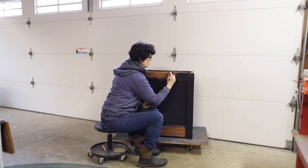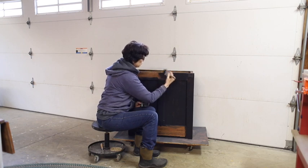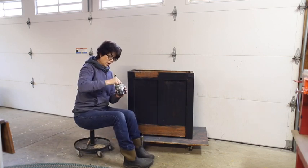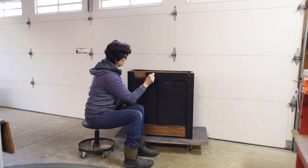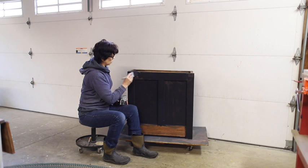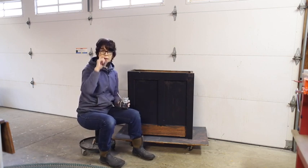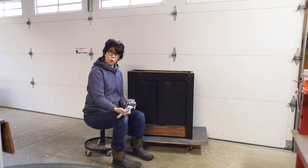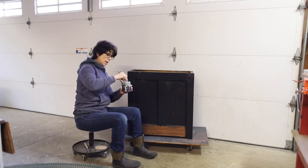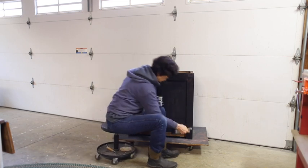At this point I don't know if my client wants any distressing. When I mixed up the paint, I added the bonding agent because I really don't think she wants a lot of distressing — she would not want that chippy look. If you don't add the bonding agent, this paint chips really beautifully, provided you haven't sanded your piece too much. The chippiness happens because there's a bit of a resist — whether it's something like wax or oil applied before painting, or the shine naturally on the furniture from the old finish. So these are decisions you have to make before you start painting.